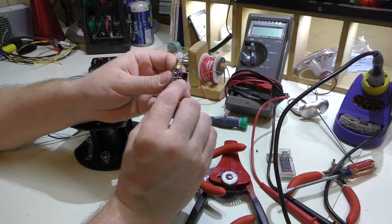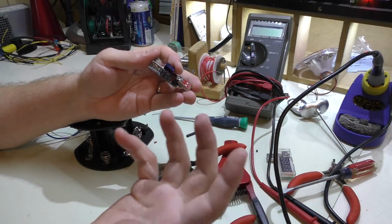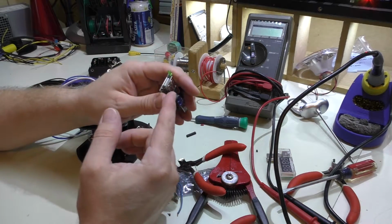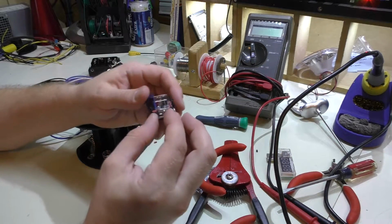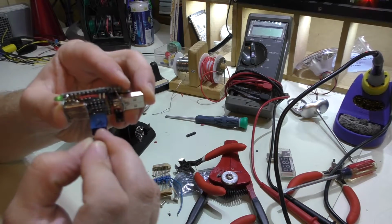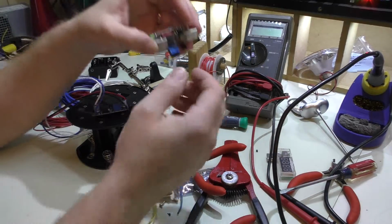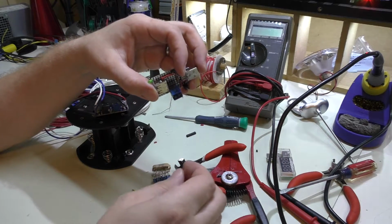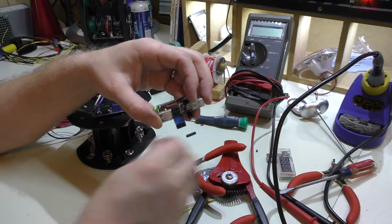And also I have a terminal block on the side, so if I want to, I can actually take another source of electricity, basically hook it into this terminal, as long as it's 5 volts, and I have a quick way to add a USB terminal to it. And then I did something with these little jumpers here. If you pull the jumper off, it exposes some pins, so that way if you wanted to take an alligator clip and just clip it to it to get power from it, you could do that. Or I have smart board connectors, which actually has a little plug that sits over that.